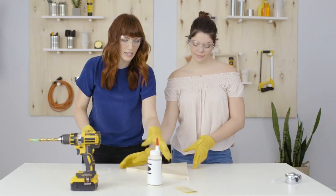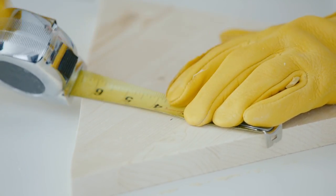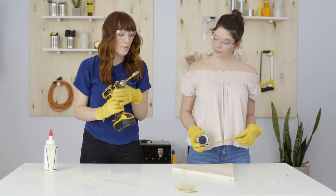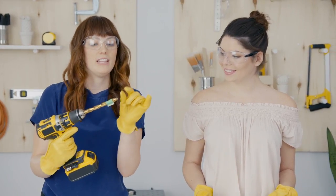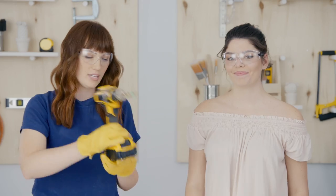I'm going to use this as the back and we are going to drill. We took our drill and measured how deep our piece of wood is, then marked that with tape, because we're drilling a hole in the back that's going to be used to hang it and we don't want to drill all the way through. Now we know just how thick our wood is and we can only drill halfway — from the tip to midway between the tape.